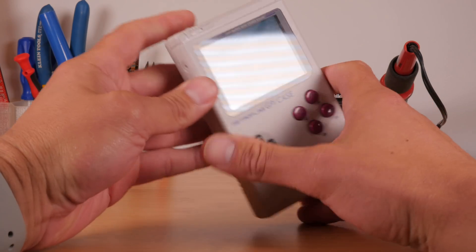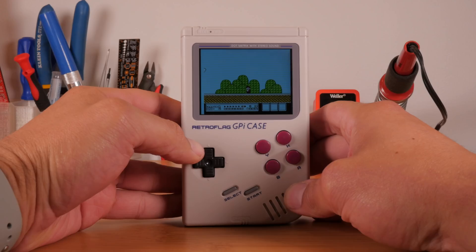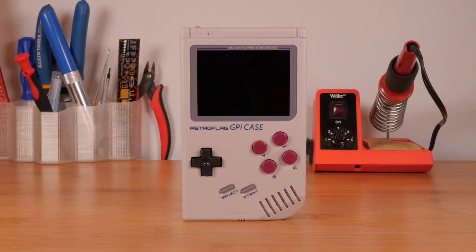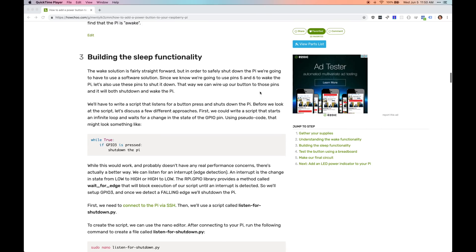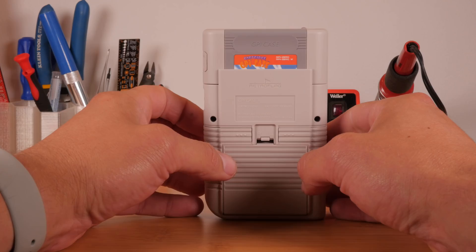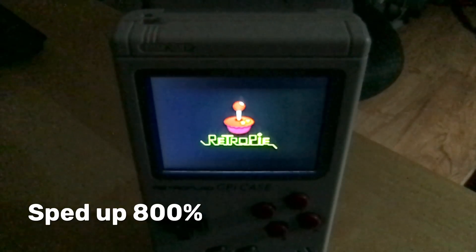The safe shutdown button is important — when you turn off the Raspberry Pi, you want to do it safely. Like a desktop computer, you wouldn't just rip the cord out of the wall to turn it off. Anything processing at that moment or being written to memory can get corrupted. It only takes a few times of improperly shutting down your Pi to totally corrupt the operating system, requiring a full reinstall. RetroFlag cleverly created their own shutdown scripts that you can pull from GitHub, and you can use the toggle button on top to safely turn the unit on and off. When tested overnight, when the power gets low, the LED starts flashing and then it does initiate a safe shutdown — a really nice touch.